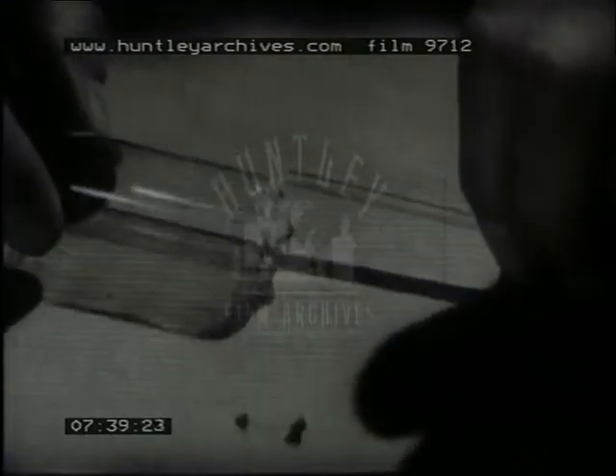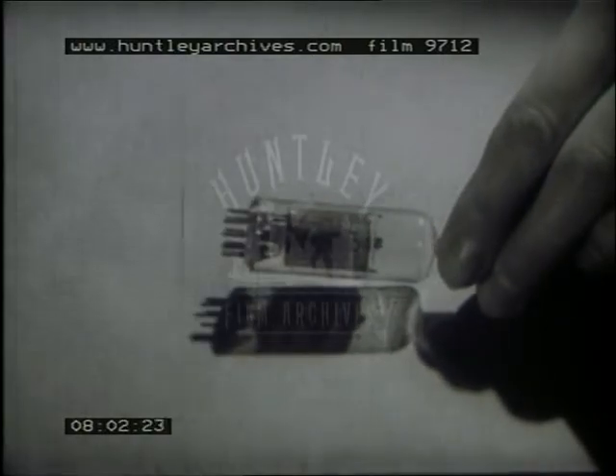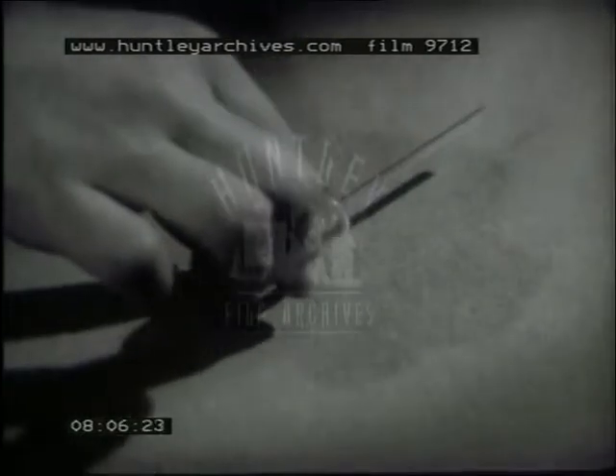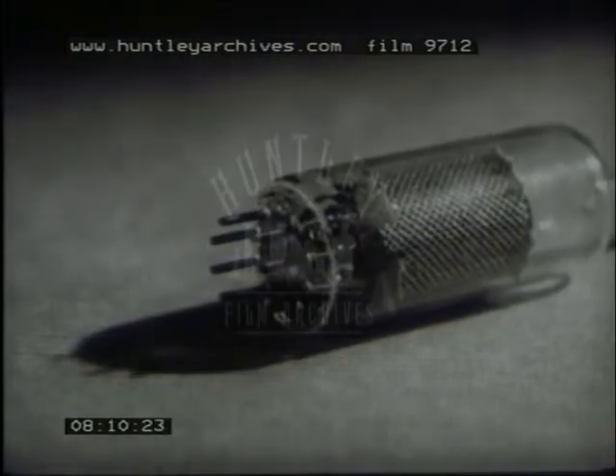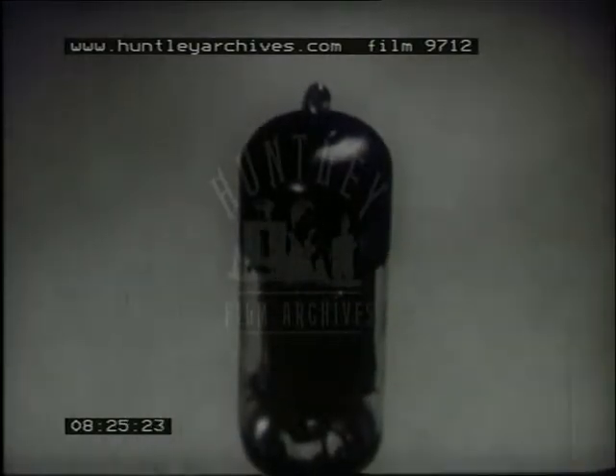The bulb is a glass tube with one end closed, and to this is attached a thinner tube in such a way that the passage is opened between the bulb and the tube. It's through the thinner tube that the air is withdrawn from the valve during the pumping operation. The electrode assembly is placed in the bulb, and the junction between the base and the bulb is then heated so that the two glass surfaces fuse together. The valve is then plugged into the pumping machine, the air is removed and the valve sealed off, leaving a short pip at the top which is the remains of the pumping tube. The dark area on the inside of the bulb is due to the firing of the getter.